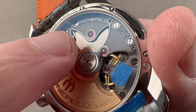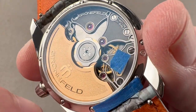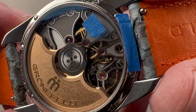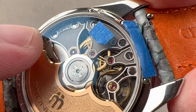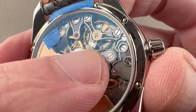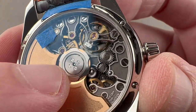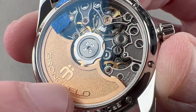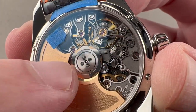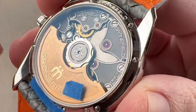Speaking of the old-fashioned way, if you look at the bridges, they're shaped like the bell gable roofs of traditional Dutch buildings to let the snow fall off. These bridges are made of stainless steel, which is notoriously difficult to finish — the Grunefelds showing their Audemars Piguet–Renaud & Papi pedigree by triple finishing these steel bridges: a mirrored bevel on the outermost face, then a raised satin channel, and within a recess inboard of that channel, media blasting. The watch has a full balance bridge and a free-sprung balance for better shock tolerance, and the balance bridge has been fully skeletonized. We have at least three separate finishes on the rotor — black polishing surrounding the bearing, with black polished screws and solarization at center. All wheels feature satination, the barrel features solarization, and all screw heads are black polished with chamfered slots and chamfered circumference. All of this is water-resistant to 30 meters.